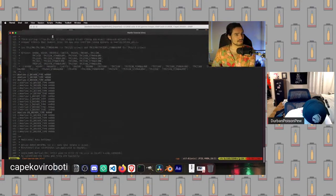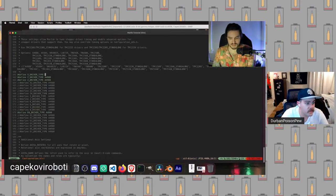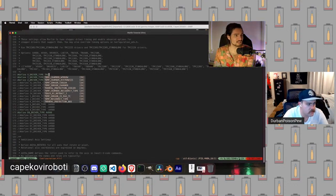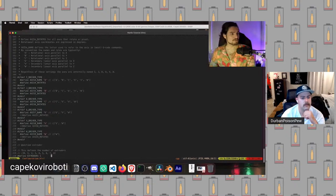But if, for example, our driver was a TMC 2208, we would go in here and manually change these. So TMC 2208, and then we would just replicate that for each of the drivers. So on line 162, 163, and 175. Okay, so we're going to keep scrolling down.